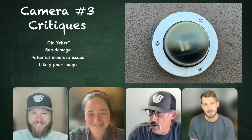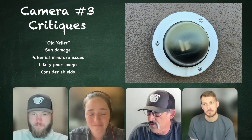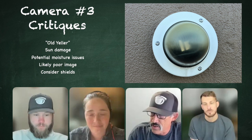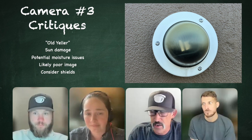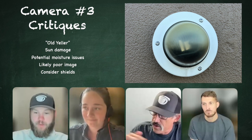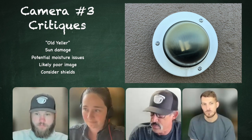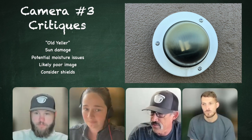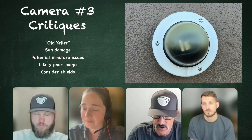I wouldn't use a dome bubble. I wouldn't use a dome style if your environment's like that. But there are domes that have sun shields also. Not sure if we have those or can get those. We will soon. You see how that top half is the discolored part? That's what the sun shield would be. But it all depends on what your view is, because if the sun shield is going to cover your view, then you can't use that. Then you got to go to a turret or something.